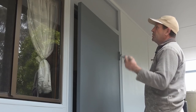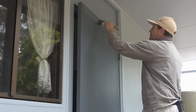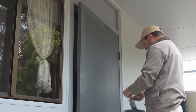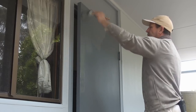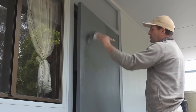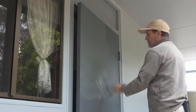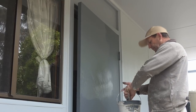If you're using a small brush it's going to take a long time, which means the paint will most likely dry before you have a chance to do it properly. I'll start at the top with plenty of paint on the brush. Being water-based paint, you don't want to be doing this on a bright sunny hot day — it's best to do it first thing in the morning or in the evening. At the moment it's a coolish day so it's not going to dry too quickly.